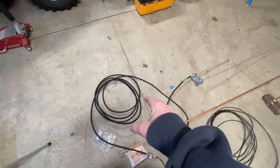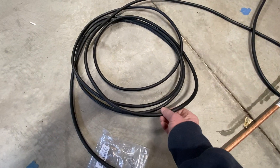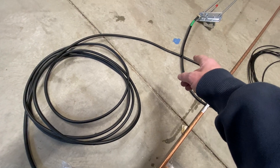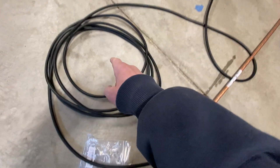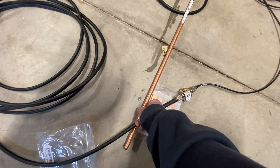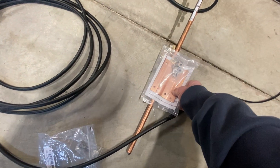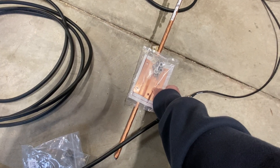The feed line is a low-loss, really thick, high-quality feed line - I think this is an RG-8 or something. It's real low loss, really heavy, and not very flexible, so it's good for outdoor use. I'm going to mount that on there and it's going to travel down to the ground rod right here, which I've got to drive in right now. I'm going to drive that into the ground about eight feet and leave a few inches sticking out.